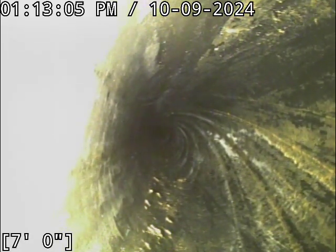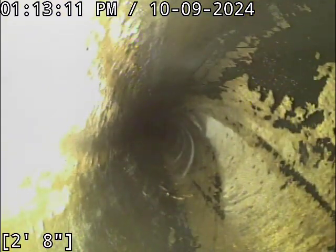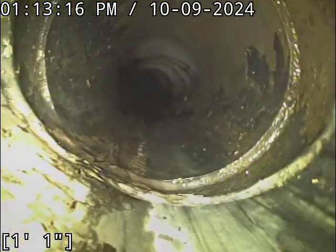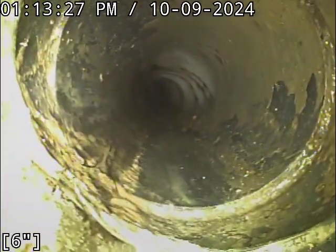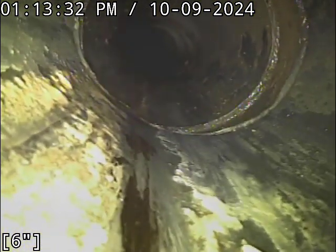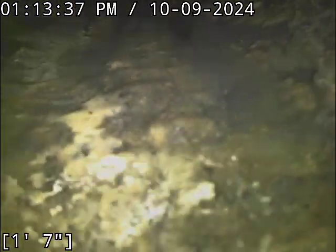We still have a little bit of water — I think that's probably coming from inside the house trickling through. That's not standing water, and it wouldn't be a meaningful amount anyway. There's where the line bells out to 4-inch pipe, right outside just in front of the clean-out access. So it goes 3-inch ABS through the interior of the house, then 4-inch ABS about 6 inches to a foot away from the clean-out, and then it transitions over to 6-inch concrete around the street edge.